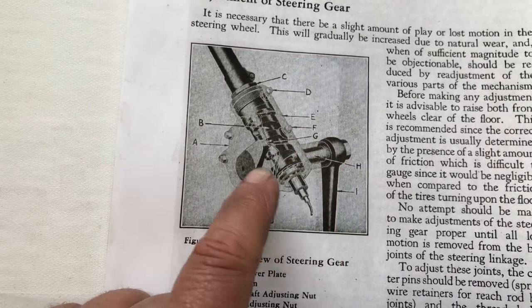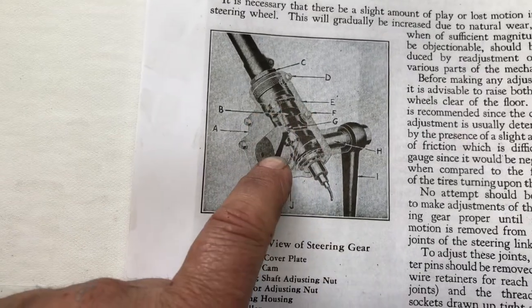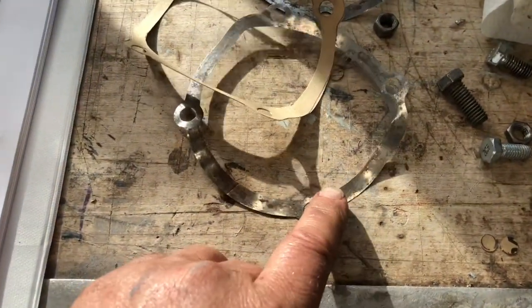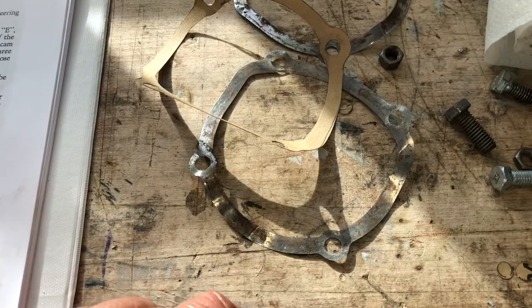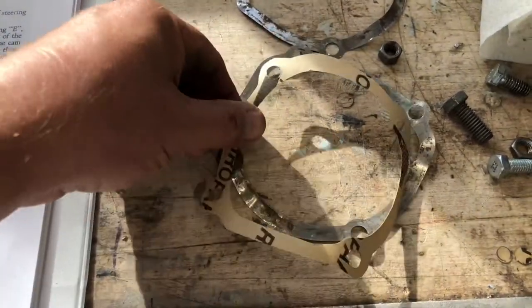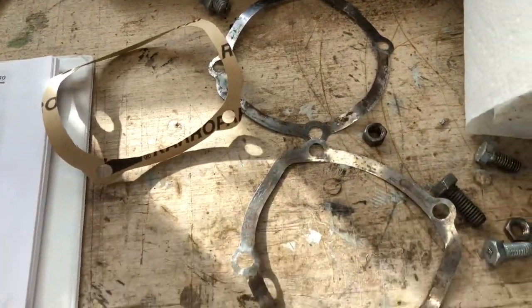What I'm going to be doing today is adjusting the throw of this shaft, because if there's too much play in the wheel or not enough, you can have problems. The way you do that according to the manual is you open her up and there are these steel shims inside behind a plate, and you either take them out or add them. I'm taking them out to account for some of the wear on the little knurling thing in there, the little nut. You have to put paper shims or paper gaskets between each of these, otherwise you're going to get a lot of leaks.